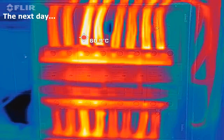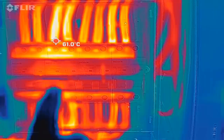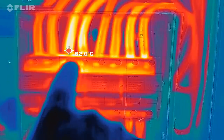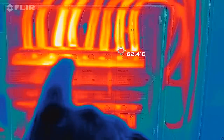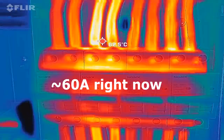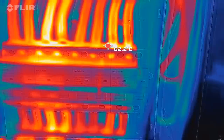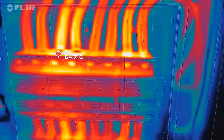We have to wait for tomorrow now. The sun comes out, heats everything up, and then we have another look with the infrared camera. Very keen to see if there's a difference. Now looking at our isolator box where we took off the ferrules last night — this is the west roof isolator, these two cables have no ferrules anymore, entrance and exit. But they are still the hottest because this is where most of the current goes through. No difference with or without ferrules in this location. Still 65 degrees.